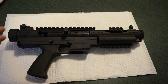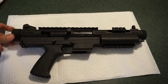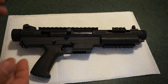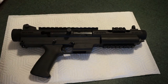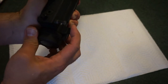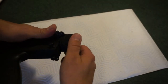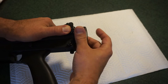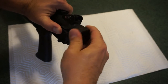At this point, the gun looks straight up like a Star Wars blaster — something you'd see a stormtrooper carrying. Now, to remove the bolt carrier group, the blowback action, and the charging handle, you push on a little release tab on the rear, similar to the one on the front. Be careful — there are a couple inches of spring: your recoil spring and firing pin spring will be popping out, so do this slowly.